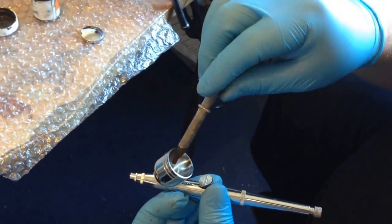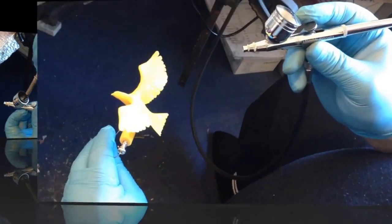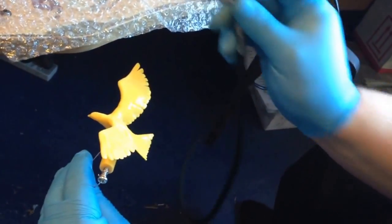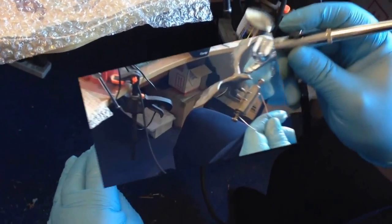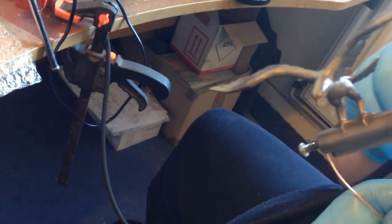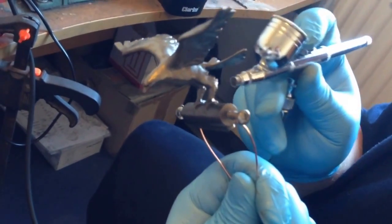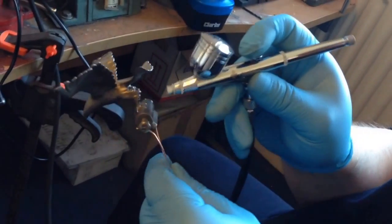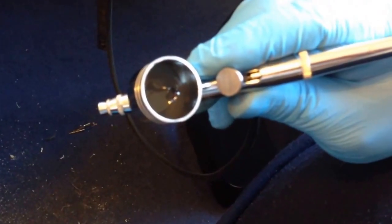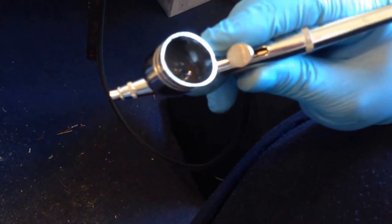We are only putting about 3ml of conductive ink into the airbrush. This will cover about 3 eagles. You need to ensure you spray an even coat on the item and not too thick. It is also important that you spray around and on the screws for good conductivity. You can see that there is quite a lot of ink left over after spraying only one eagle, so there is enough to spray another two eagles.